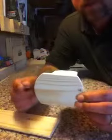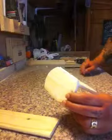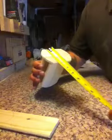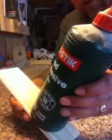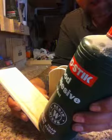And for the base, which is 4 inches wide by 2 and 3 quarter inches. With the base, measure the length of it, draw around your template there, slide it down to the end of the length that you desire, mark it again, and cut it out with your coping saw.